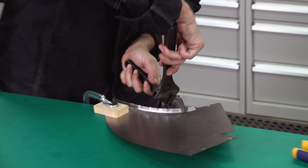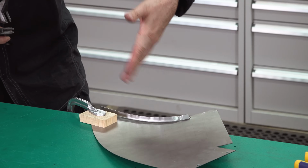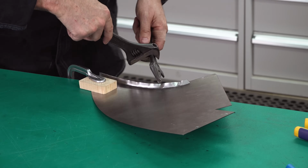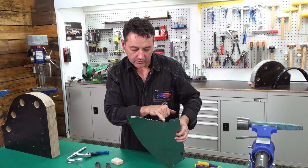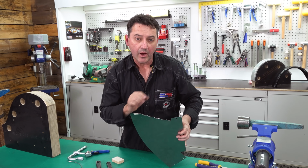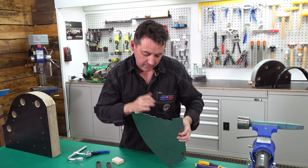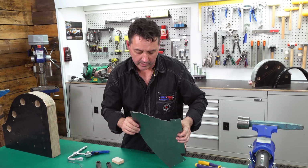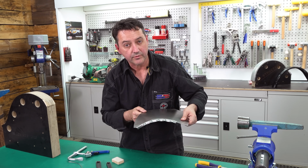You can see quite clearly it's forming a pucker, and you can actually see the sheet metal beginning to shrink. You can see here these ruffles or shrink puckers are facing the outwards direction. So therefore, later when I come along and planish it, it'll be working inwards. If you go inwards, then it's going to be counterproductive. It's not going to work the way you expect it to work. You can also see from the front profile how much that's beginning to curve.